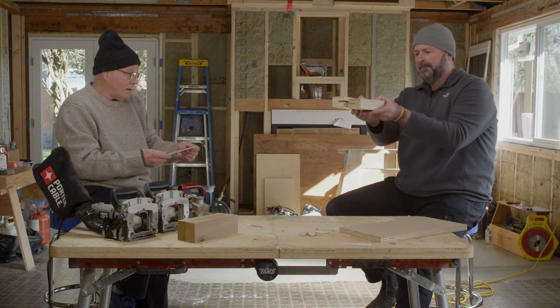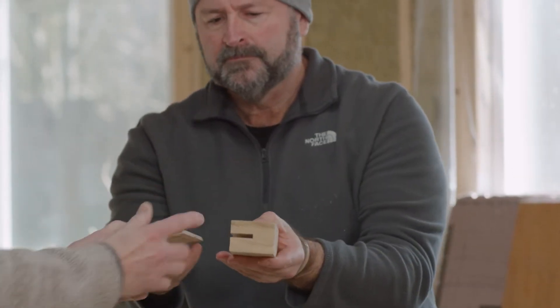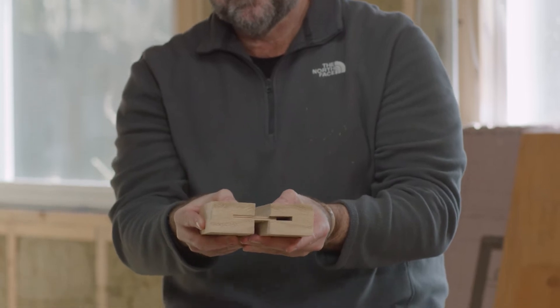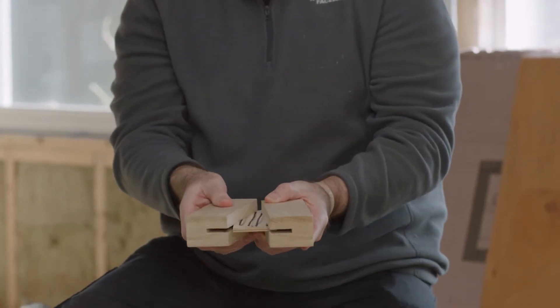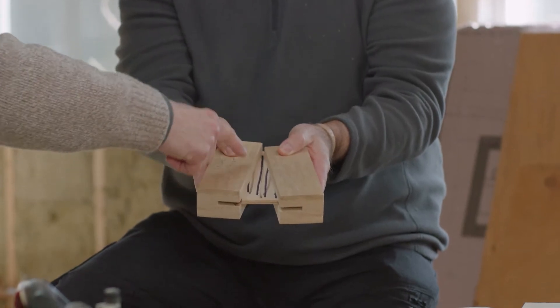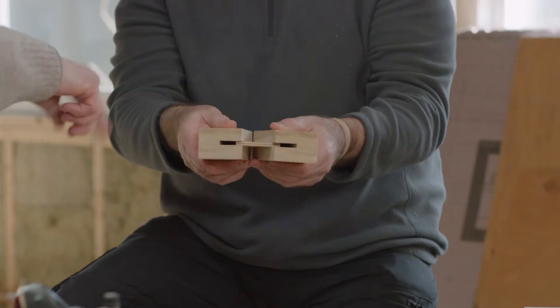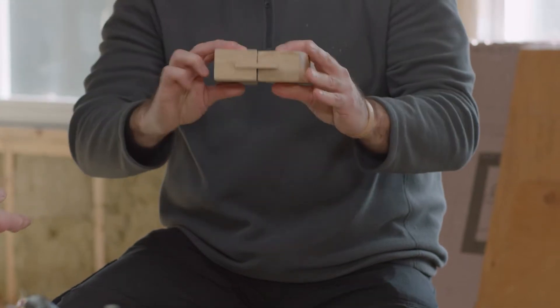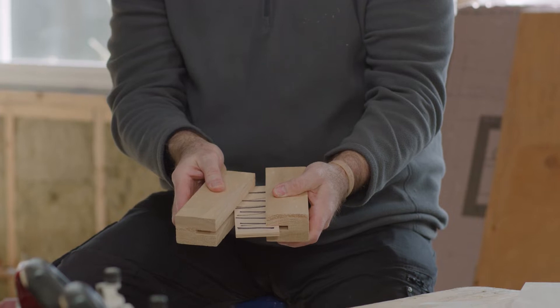Now that bridge — when we often use this, we're going to use this piece of plywood as an example. If you pull it a little bit apart, you'll see the grain for this spline is going this way, which would mean you could snap it. Now, if you flip the piece over completely, you'll see the grain is going across the joint, so it's much harder to break.